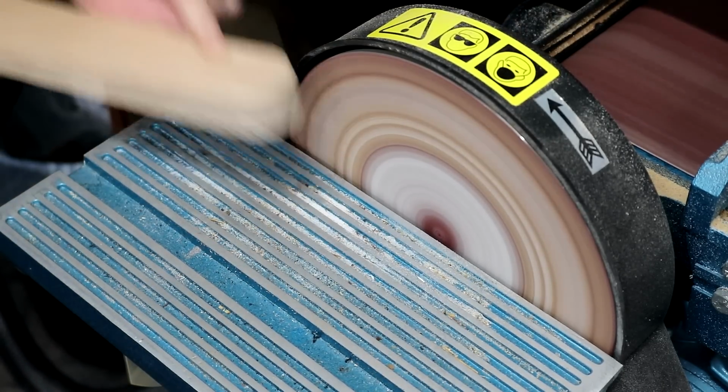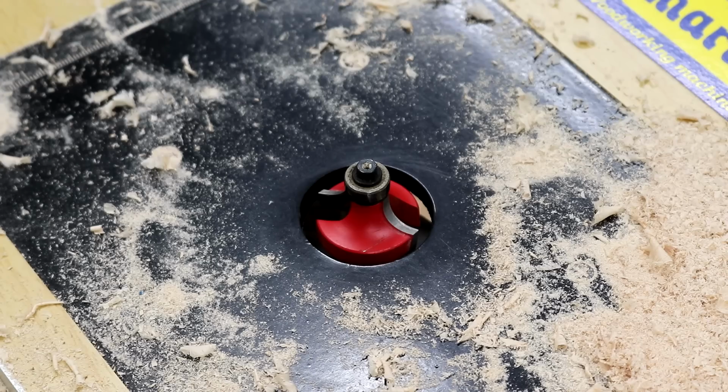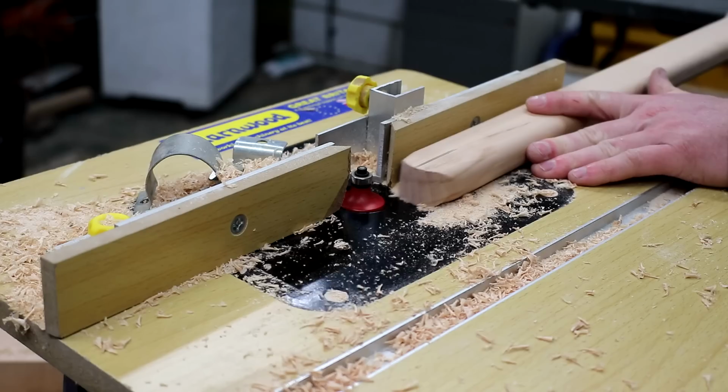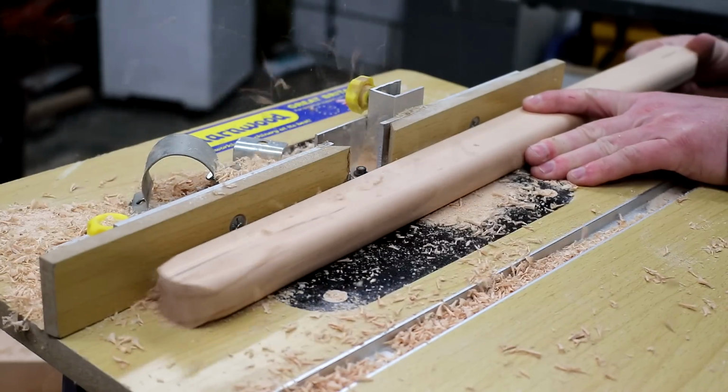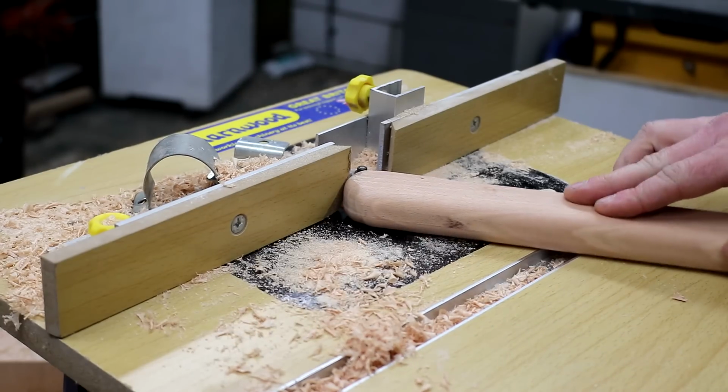Next I set up my router table, and this is a tool that I don't think I've ever used in a video on my channel, even though I've had it for about 4 years, and that's mainly because router tables scare me a bit. I fitted a roundover bit and I can use that to soften all of the edges of the legs, making them baby safe with no chance for them to splinter.